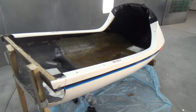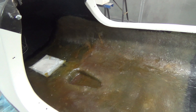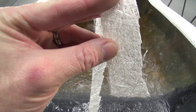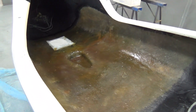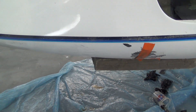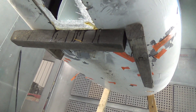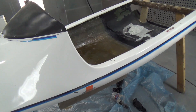Alright, so here we have the pod fiberglass — just look at it! We had some serious cracking going on all the way around. They put in three layers of fiberglass and I think about a gallon of resin, so that's probably about eight pounds added. It's a little heavier, but the plane was tail heavy with the 582 on it anyway, so that'll probably help balance it out. Down here nothing's happened on the bottom yet — we're letting the inside cure first, then we'll flip it over and do the outside.